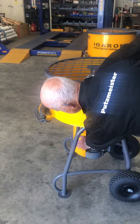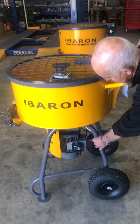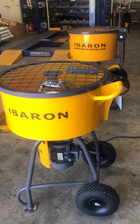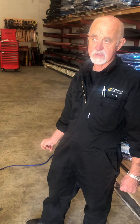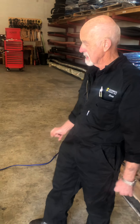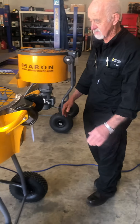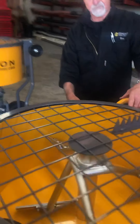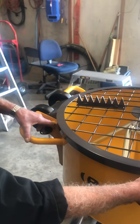Or you can hand shovel the material in, add water, it mixes and discharges. On this particular model we have a safety guard at the bottom to protect the motor, and a more sturdy frame than the E120. Both machines are single phase — they will run off a 10 amp household plug through an RCD, which can be just a plug-in type, so there's not a lot of expense in that.